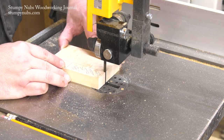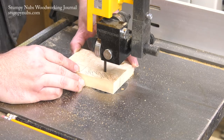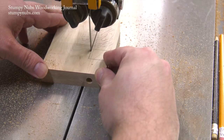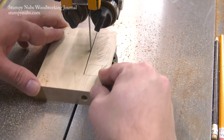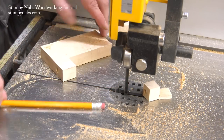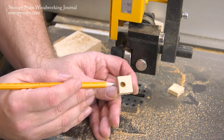Now you'll have to cut away the waste areas we laid out earlier. A bandsaw is a good tool for this, but you could use a handsaw if you like. Just try to make your cuts nice and straight so you don't have to do a lot of sanding when you're finished. As you cut the long line, stay on the side of the line furthest from the edge of the block and save that three quarter inch cube you cut away. That cube is going to have a hole near its edge, which is why it was important to cut on the right side of that line so you don't accidentally cut into your hole.